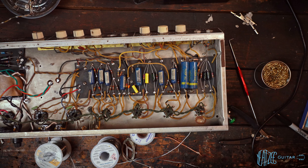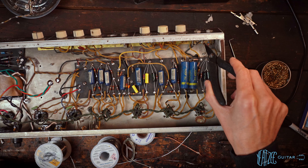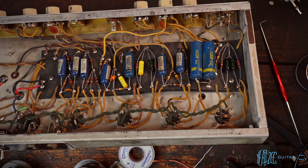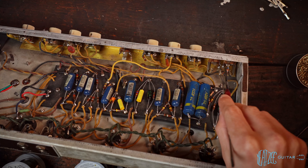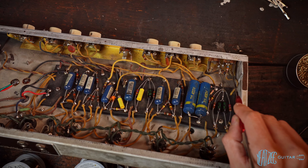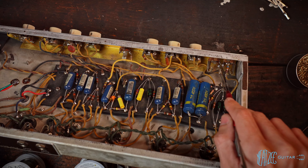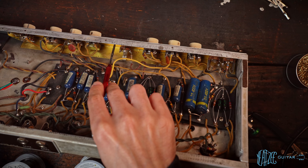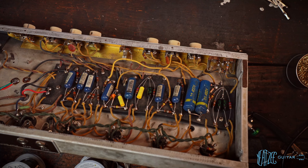To be honest, I was hoping to be done with this amp tonight, but we're not even close. This input jack has a 1 meg here and a 1 meg here — that's not wired properly. And you've got the two 68Ks here. This is all going to have to be redone. And then the one over here — we're obviously missing a jack. That's because that's where the master volume mod was, so that's going to be replaced. This is going to have to be rewired properly as well. So that's all jacked up — there's still a lot of work to be done.